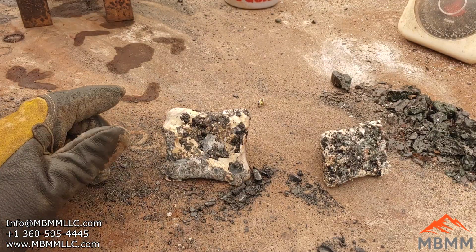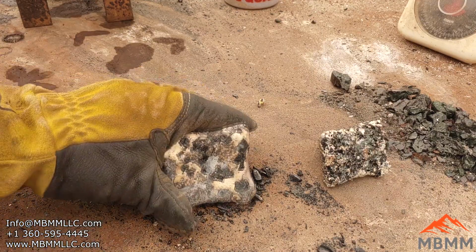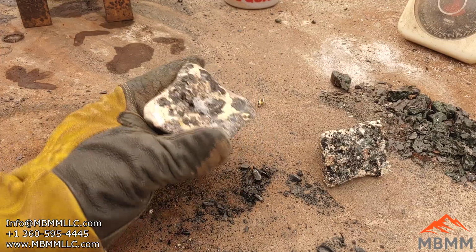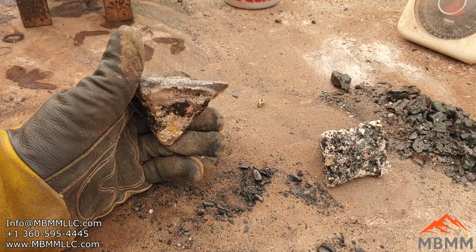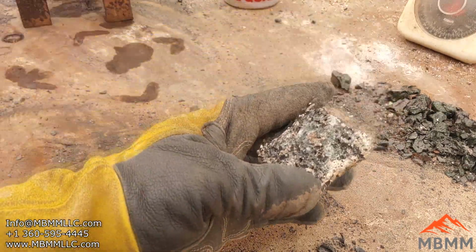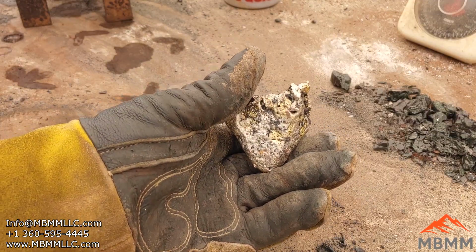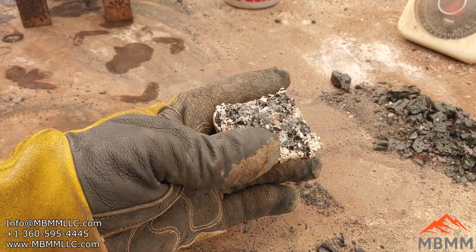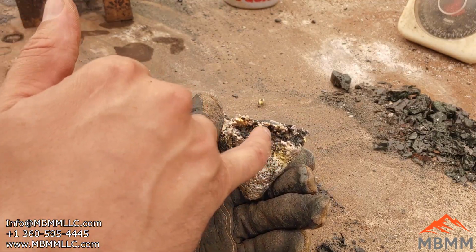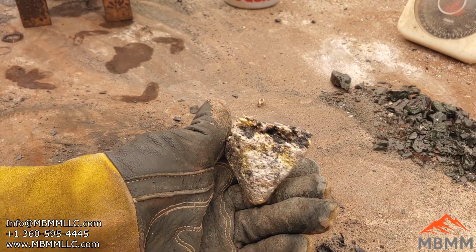All right, YouTube, here's my problem. Somebody help me solve this. So here is the number 1 stuff, the high-grade concentrates. I melted them down once, added borax to try and get all the oxides soaked up, and it looked a lot like this one, where it was all gnarly on top. When I poured it, there was clearly liquid metal, but then a bunch of kind of foamy, dense junk came out on top, made all this kind of nasty-looking pitted stuff there on top. It didn't all collect down in a nice cone.